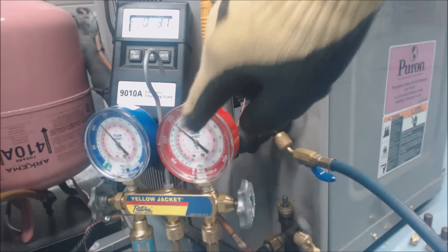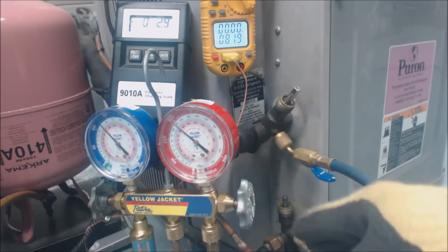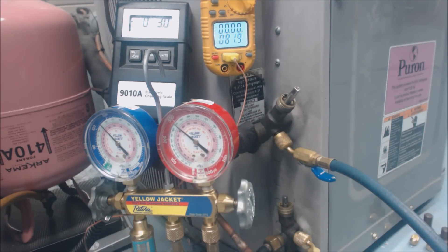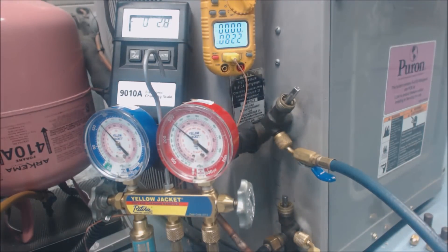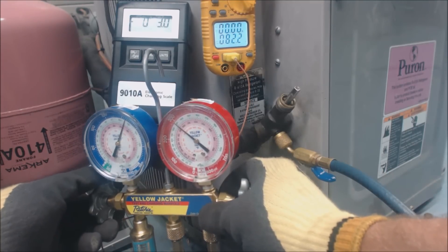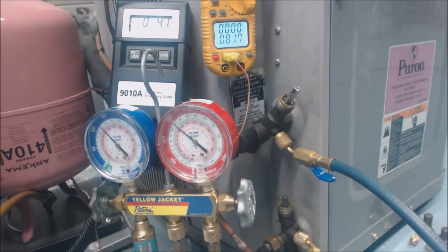The pressure rose up a little bit. Before it was at about 93.7°F saturated; now we're at about 94.2°F saturated. Our actual temp on the liquid line is dropping. Presently we're at about 12 degrees of subcooling. We want to let it sit for a sec and let the refrigerant cycle through the system in order to get an accurate reading. Normally you let it sit a bit longer when you're that close, but you can use that time to fill out the service ticket, write down model and serial numbers, and so on.